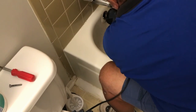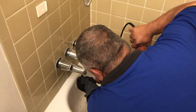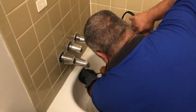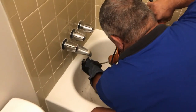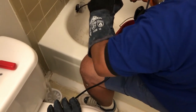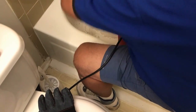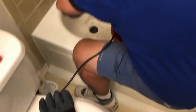It just got past the trap and it's going down. It's draining right now. If I couldn't get through the trap, I would have actually put the drill in reverse and pushed it through — because sometimes going forward doesn't work; you have to go in reverse. You can still push the snake forward in that mode, so that's just what I wanted you guys to see today.